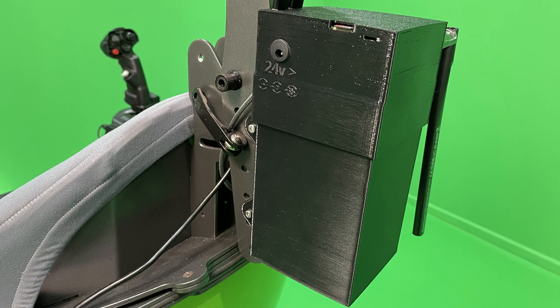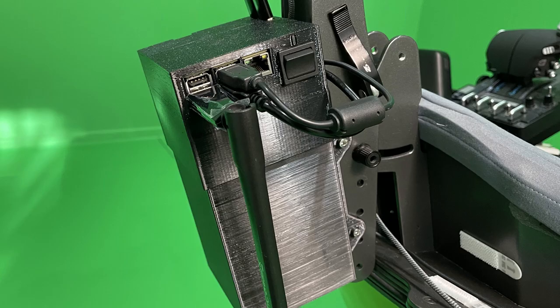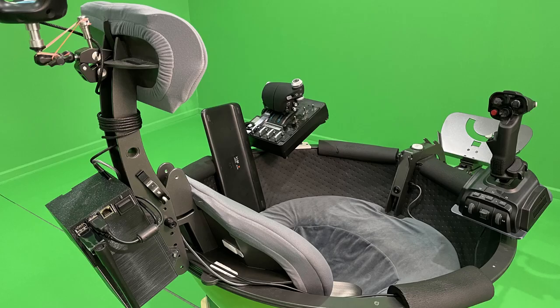Okay, first let me show you the finished solution. On this side of the box we can see the 24 volts for the force feedback and access for the Raspberry Pi memory card. Switching to the other side you can see the primary power switch and a Raspberry Pi inside the enclosure with a Wi-Fi antenna and two peripherals plugged in. From this wide shot you can see there are two USB ports at the top of the box and they run to the Vive tracker and the IMU at the front of the Yawr. From the Pi, the two peripherals plugged in are my HOTAS throttle and stick.